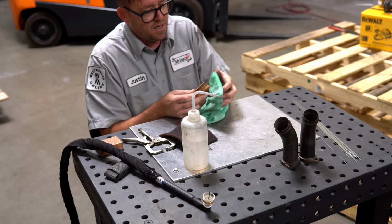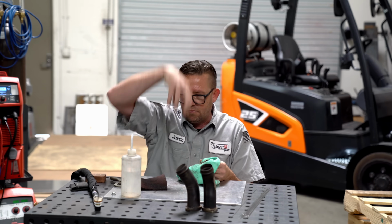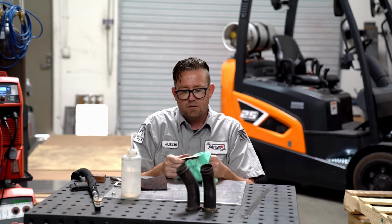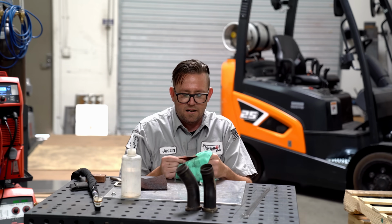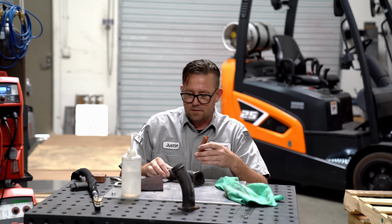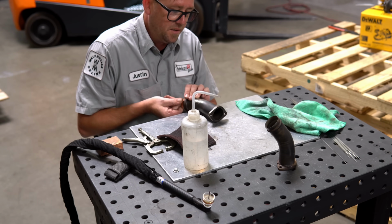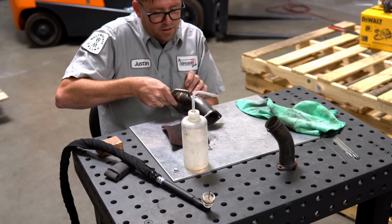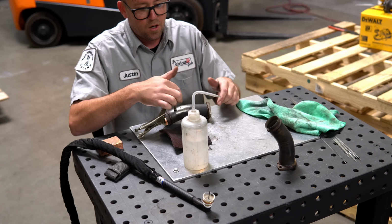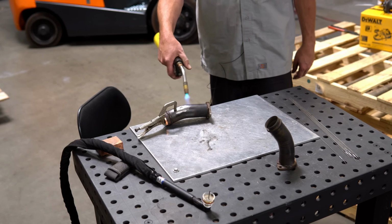Normally you would fill up the part with argon, but as I mentioned before, if you have air trying to come out of that hole and you have gas trying to come out of that hole, in this case argon, and you have it trying to blast down on top, that could create a bit of turbulence, just the same as my fan back there is blowing on me. I gotta turn that thing off in just a moment. If you have turbulence on your part and it disturbs your gas flow, then it's pretty bad. So we're gonna take this piece of copper and really try to get it super tight in that hole, so that atmosphere or oxygen can't reach the part. And if it can't reach the part, it won't oxidize the part, or it won't sugar it up.